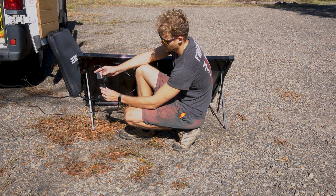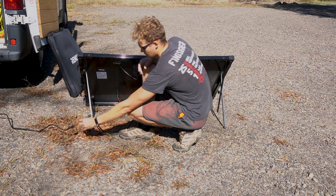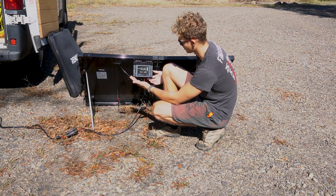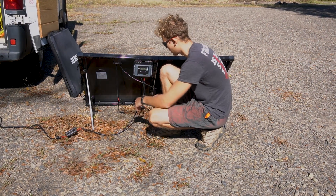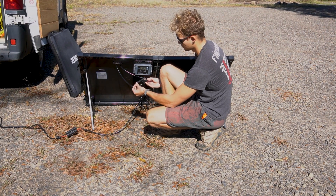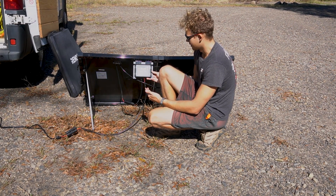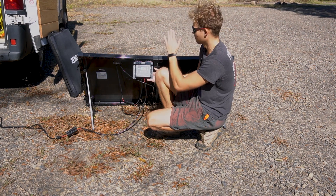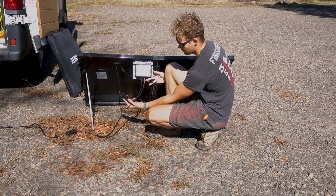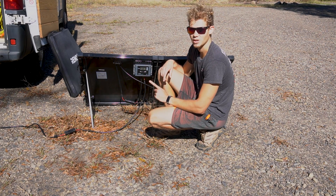Now that we've got our cable going to our battery, we'll connect the MPPT charger. Our charger is now hooked up to the battery — the LED has popped up telling me we've got 12.9 volts, everything looks good. Now we can go ahead and connect the solar panel to the charger, which is plug and play. Right now it's not showing much because we're facing away from the sun — I just wanted to show you what the wiring looks like back here. The velcro is up nice and easy.